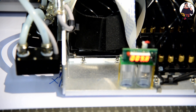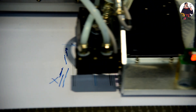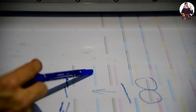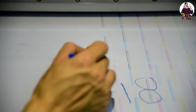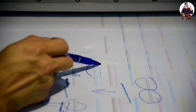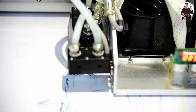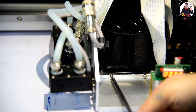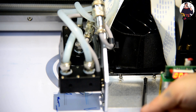We press X-Home and go to test. We click off the wire margin and test vertical calibration. Now we can see it has moved to the right — too much. Before it was to the left, but now it moved to the right too much, which means we adjusted too much. We need to adjust back a little bit. Same way — move the carriage out of home position and adjust a little bit.